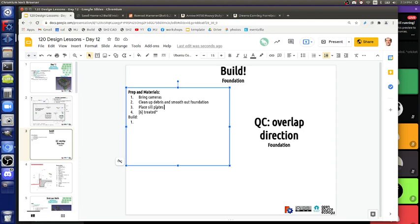Now, you can never get rid of mice. They're always going to find a way in, but you can make it hard, and therefore it's not a persistent problem. Here and there, you get mice. But if you don't pay attention to that, you'll have mice all the time, especially in the country out here. The sill gaskets are sealing the air holes. This is about high performance housing. Sill gaskets are industry standard. That's basics. We're going to put one below the sill plate and one above.